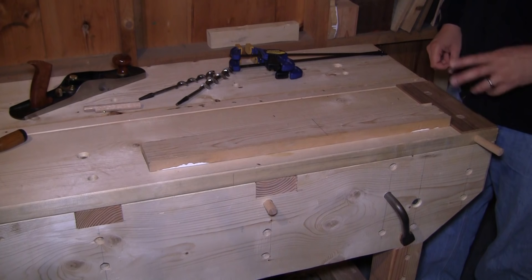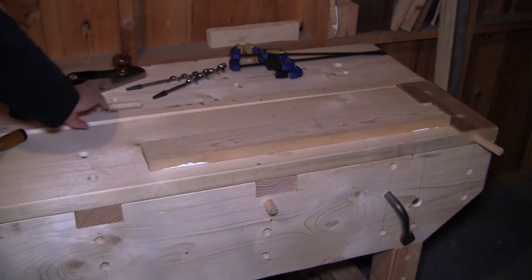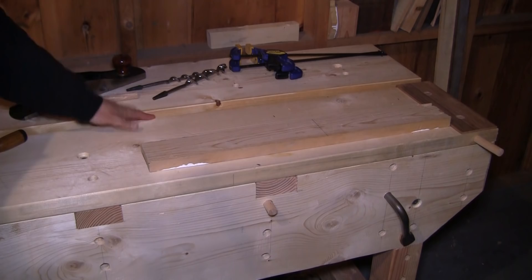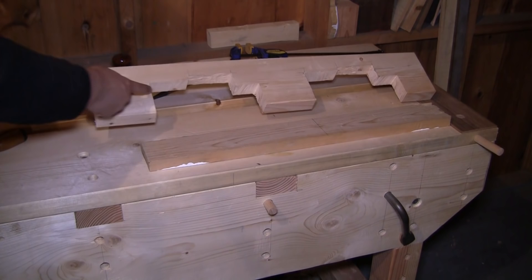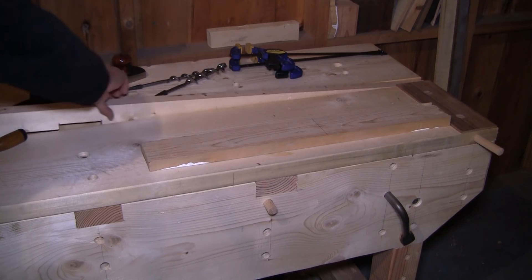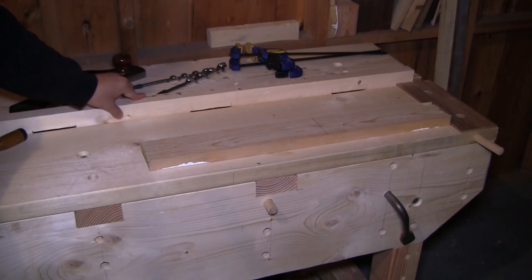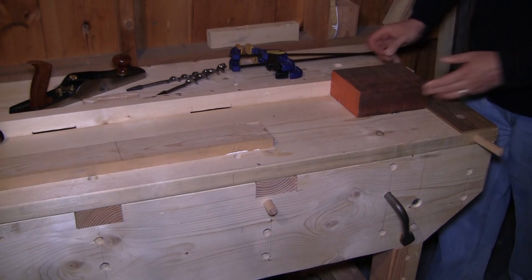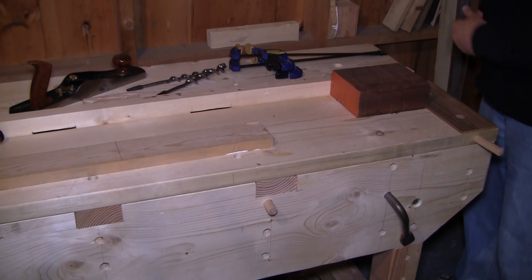The center notch here is certainly nothing new. These benches are made up of two slabs, and I've got four-by-four braces running at three points along the bench top, giving it a really strong base. But the planing notch, or planing beam, has a cool stair-step pattern. If I align it with the bench, it drops down flush. If I pick it up and slide it to the left, it stands up proud of the surface an inch and a half — so I can put eight-quarter stock, or even a bit of twelve-quarter mahogany, up against it, push it against the planing stop into the inside corner, and traverse the board, go diagonal, or go with the grain — it's really well supported.